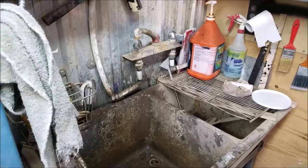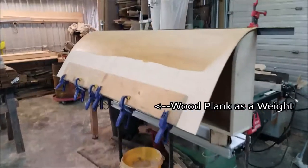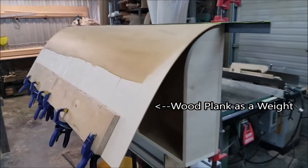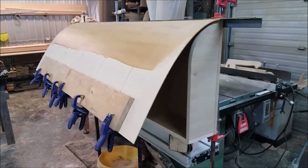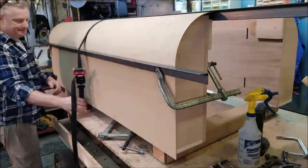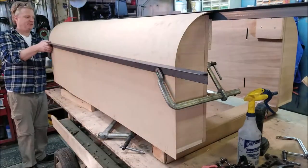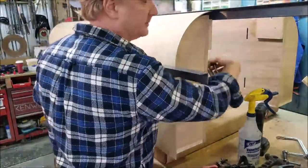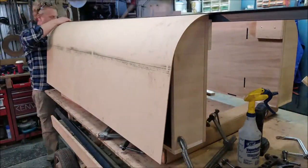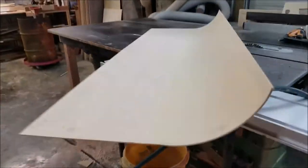These are the two upper cabinets from that pub. It was actually a lot harder to do because the radius is a lot tighter over a wider span, but the technique still worked out just as well. I used a strap in the middle to keep the center from bowing out. I should add: if you want to make this stiffer, I'm only doing a single layer — you could do multiple layers using the same technique, just keep redoing it one on top of another, then laminate those together with an adhesive.